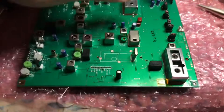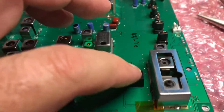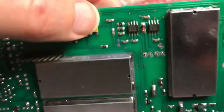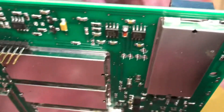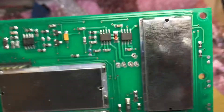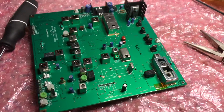This is N2LEN. We just installed the newer filter — we just pushed it in. I want to show you what it looks like before we solder it. You can clearly see the pins there, sticking right out. We're going to just tack solder it in its spot. It's seated in there nice and flush. That's basically it.